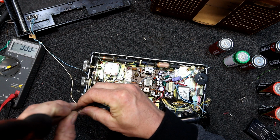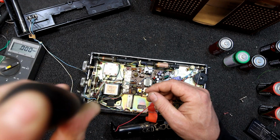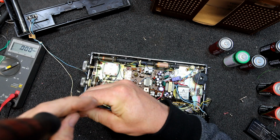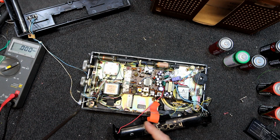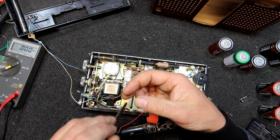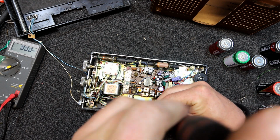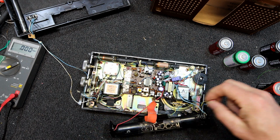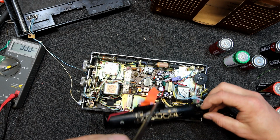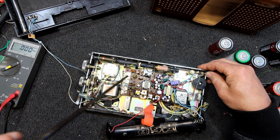Could even be worth a quick look. Well, does that undo the dial cord, that one? I'm hoping it doesn't, but it might. No, I think that's another bracket held on by this other pin, so they've riveted that down. Yeah, we're going to have to, that dial comes up over there, so it's hooked over the circuit board strangely. So that's definitely got to come out. We've got these other aluminium rivets everywhere.